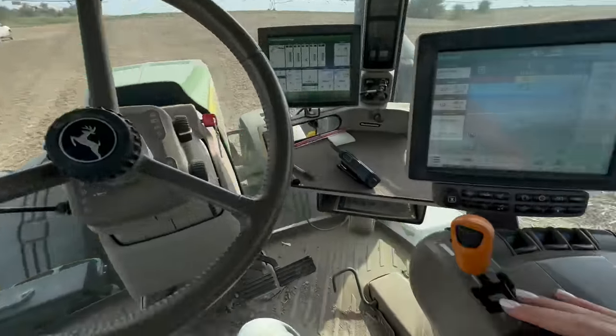8:20, calling it an evening — that's way later than I was expecting to go. Things are getting tough — really wet out here. We're racing; this is probably the fastest we've gone all day. Gage pulls away with a load on. It's not the moisture of the beans that gets too wet — it's that the stalks get too wet and they just don't flow into the head very well. The beans are still at about 11.5 moisture, so we're doing good. It's just the stalks that are not cooperating.